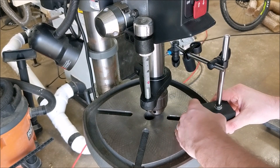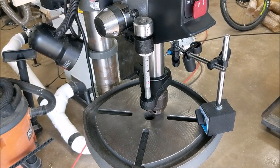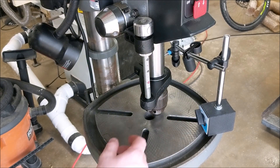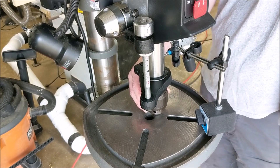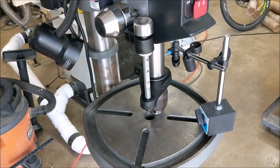Similarly I will set this up on the side here and do the same thing. Looks like we've also got about 4 thousandths of an inch deflection side-to-side. I'm not really too concerned about either one of those numbers, but I'll go ahead and show you how to make that adjustment if you need to regardless.